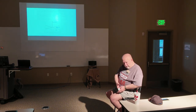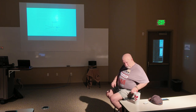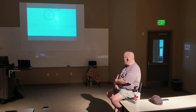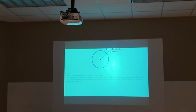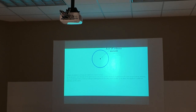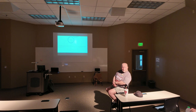Well, that's the end of that. Let's go back. One thing you've got to understand. If that dot is the vertical antenna, you're looking down the top of your vertical antenna, down this way. That's the pattern of the RF. So another good thing about a vertical antenna, especially on field day, is it's omnidirectional. It puts out the same signal strength all the way around that radiator. So that makes it good for field day, because you're not stuck on a certain azimuth of where you're transmitting if you run it between two trees.